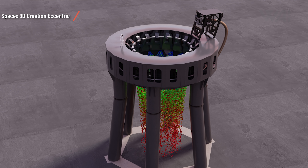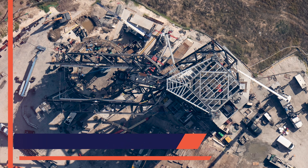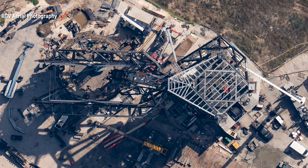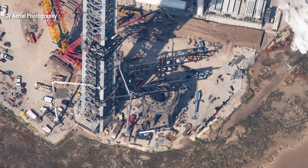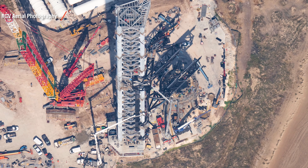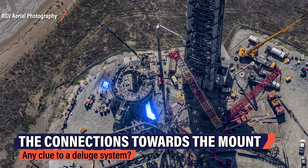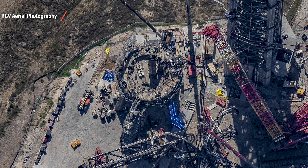Make sure to check out his Twitter and YouTube channel for almost daily animations and renders about SpaceX's Starship infrastructure. If there is a deluge system planned, it needs to either surround the mount or be integrated into it. Aerial pictures clearly show the orbital launch mount and surrounding infrastructure — but no matter from what angle we look, there's nothing suggesting a deluge system surrounding the mount itself. No connectors on the ground, no strange pipes sticking out. All visible pipes are fuel-related — large insulated pipes on the left likely carry cryogenic fluids: methane, oxygen, and nitrogen.